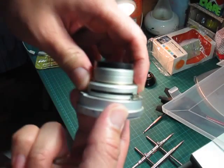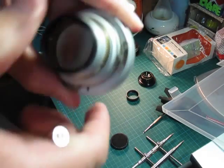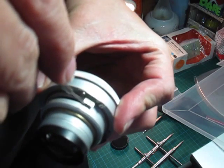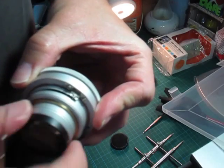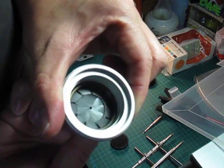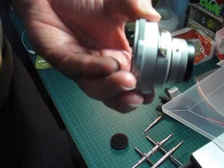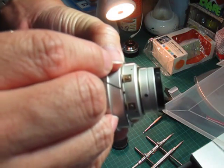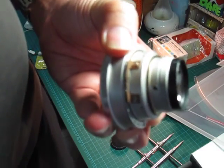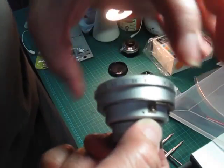This is how the aperture gets adjusted — there is a pin here held in place by two claws, and it turns the aperture to open and close it. The clicks of the aperture are held in place by a very tiny ball bearing under here. If you lose this ball bearing, you will lose the clicks — the aperture would just open and close without stops, it would just be loose.